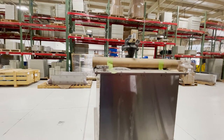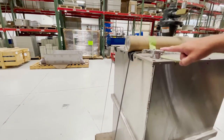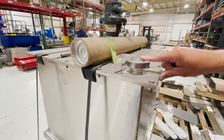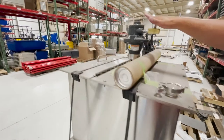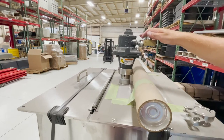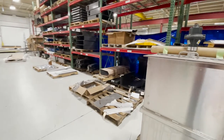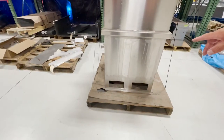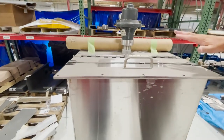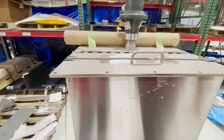All 304 stainless steel. This port here that's capped is a vent, so if you need to vent a tank outside of the building or outside of the room. It has an air-operated mixer, so it will meet your C1D1 area requirements. It has four pockets to move it around or to place it in the room. It has a hinged lid so you fill it — open the lid, add your filter aid, and close the lid to minimize fumes in the area.